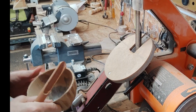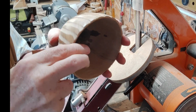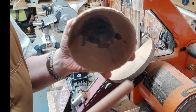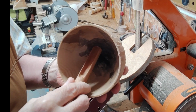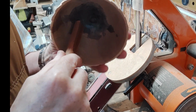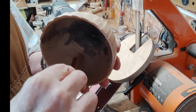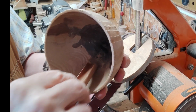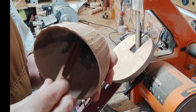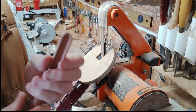And again, I could do a little bit of bowl turning in an end grain bowl, actually where the grain is parallel to the lathe, and that's a normal turn in there along the top, and if you wanted to make an end grain bowl, you could then go inside. And because the wings were swept back now, you could go into the bowl there with less chance of a catch or a digging. And because it was a short bevel, we could go right round into the corner and then across the bottom. And that's how the cutting edges and the bevels and the sweeps evolved.